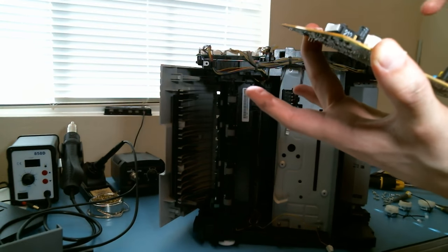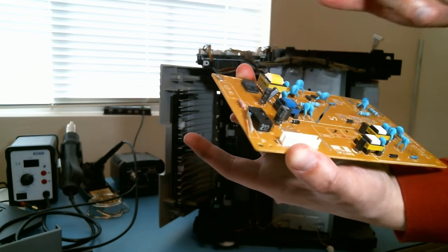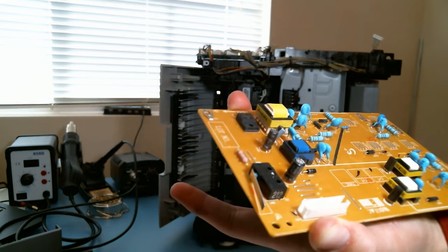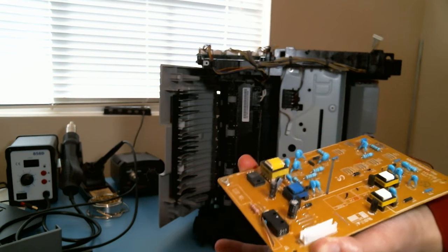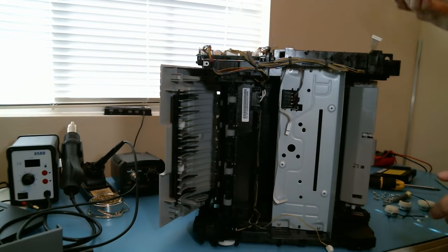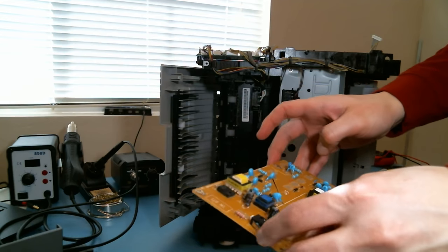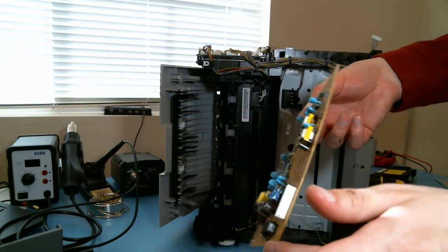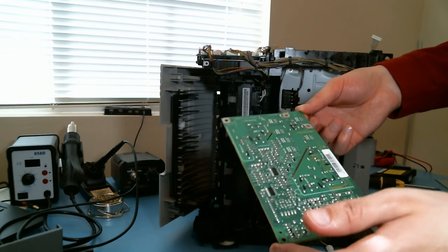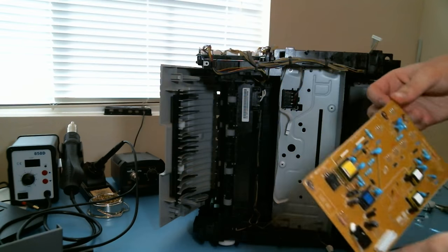Looks like the way they've drawn it out could be a voltage doubler, maybe two or three stages of a voltage doubler. Then some switch transformers, and this could be a big FET for switching them, so that'll all make sense. If you're interested in a voltage doubler, I'll ship this to you. Again, probably only to responsible adults. I don't want an inexperienced person zapping themselves with random electronics capable of generating high voltage.